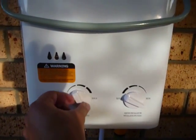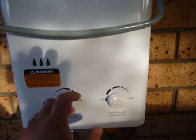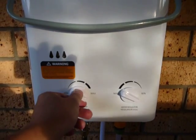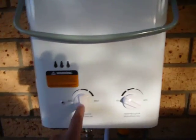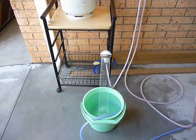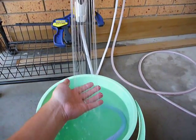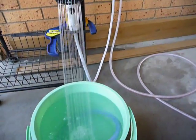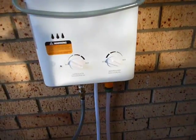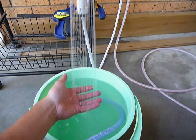The outgoing water temperature is regulated through here. With maximum gas setting and minimum water flow you will get the highest temperature, and then a mixture of the two gives you the temperature you want. If I have the unit set at maximum water flow and gas in the middle, the flow rate is more than adequate for a shower and the water temperature would be getting close to 45 degrees. On maximum water flow and minimum gas flow I would estimate around 28 to 30 degrees.